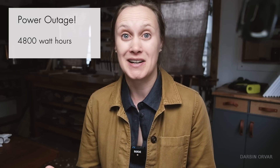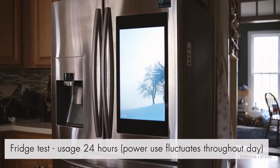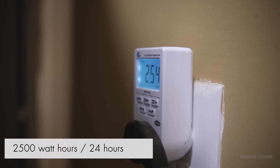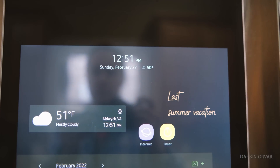I did a test with my fridge, since keeping it running would be high priority in an outage. A large modern fridge-freezer used about 2500 watt-hours over 24 hours — about 100 watts per hour on average. Imagine also hooking up some lights, a microwave or hot plate, your TV and stereo — you'd be fine for at least 24 hours without thinking about recharging. Add solar into the equation and you can go indefinitely, and you can always upgrade to more batteries.